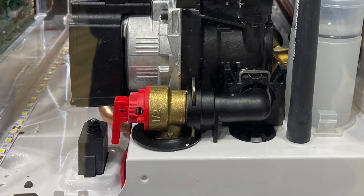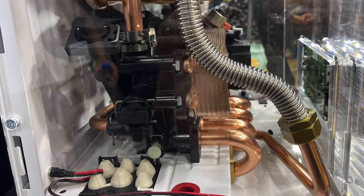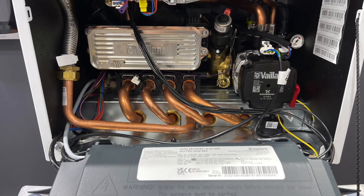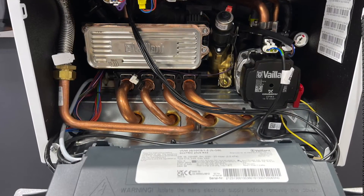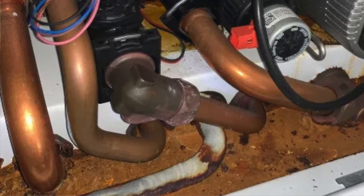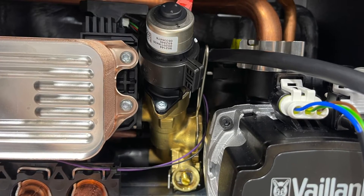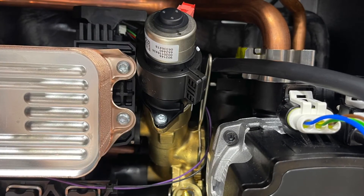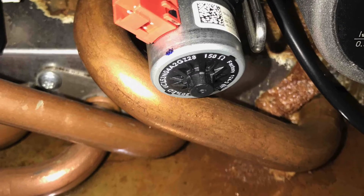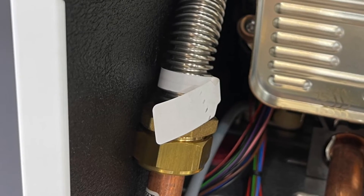Now you can remove the side panels. The pipe layout leading to the composite hydro block is completely different, and the gas pipe leading to the flexi is now made of copper and is slightly off the bottom of the boiler, so hopefully there won't be any problems with the gas connection corroding. Another quite significant change is the diverter valve — it looks like the same diverter valve, but they've put it at an angle looking upwards now instead of horizontal, so hopefully we won't have dirty heating system water coming through the spindle.